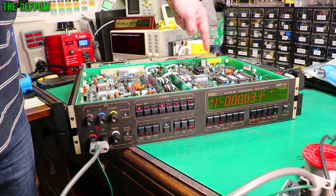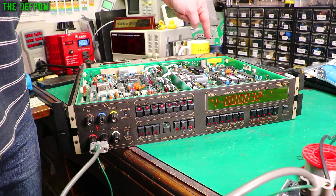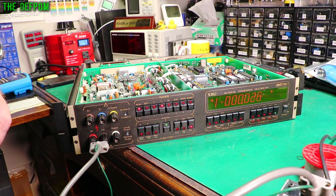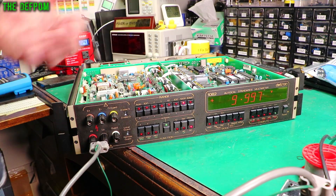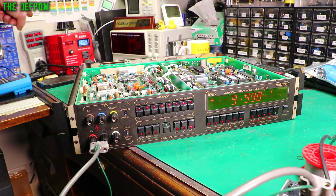It turns out the crystal used for the line frequency adjustment is set for 60 Hz — obviously here in my country it's 50 Hz line frequency. Because it's using a crystal, apparently I'll have to change it to a different crystal. Well, that's great — now I've got to find the right crystal. Testing at 10 volts — not warmed up yet so it'll be a bit off. The null button is working. It's been showing around 25 watts, so that's looking alright.